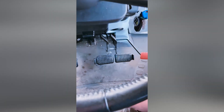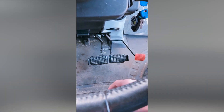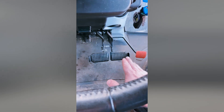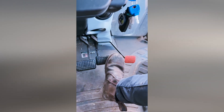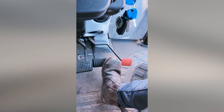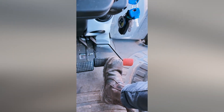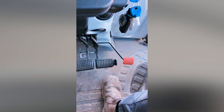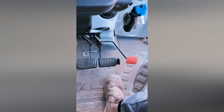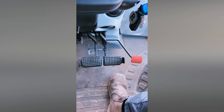Down here we have your brake pedals. Currently they're locked together, so we've got a left-hand and right-hand side. You can disengage them so that when you press the right-hand side, only the right-hand brakes work. That's very handy for when you're turning — like plowing or using drills in the field — it makes turning on a headland much easier.